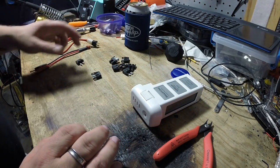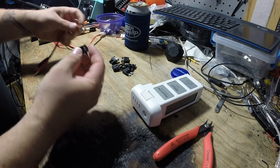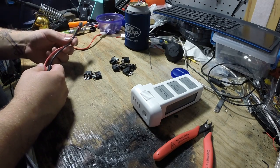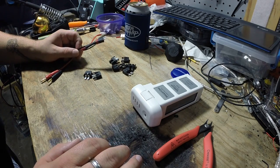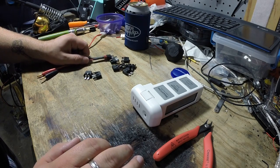I tested it out with the Deans that I'd already done — literally, you just snip those two clips off and it plugs right in. I used the lithium polymer LiPo setting, three cell, four amps to charge it, and it worked very well. However, it only got 92% charge.